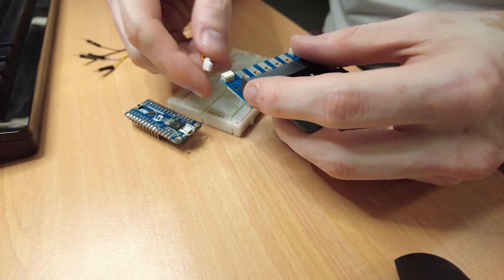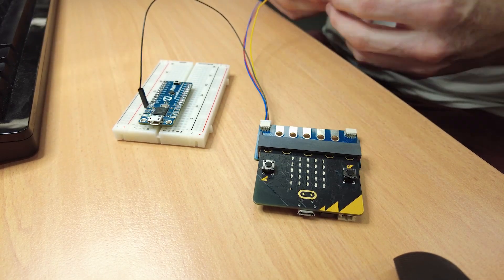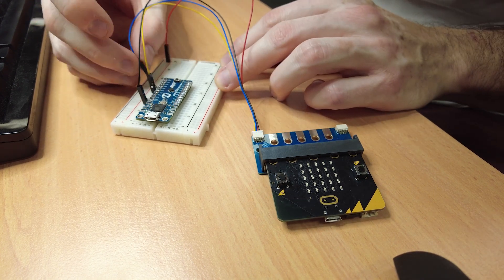It doesn't take too much imagination to see that by rolling our own I2C device and using a microcontroller's firmware to act as the bridge between a non-I2C-enabled sensor or output device, we could expand PicoDev to include so much more functionality — buttons, buzzers, bar graph displays. I've done a little bit of preliminary work looking into that. I got an ATtiny development platform and using the wiring library created a basic I2C responder device — a device that can be addressed.